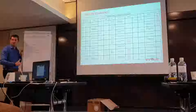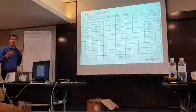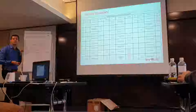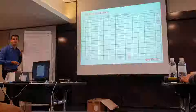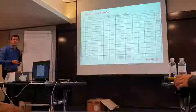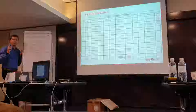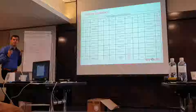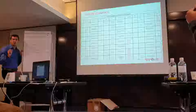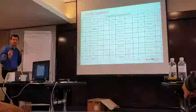Not only the minimum mode, it's possible to do it in normal mode, but there are specific things to respect. Read the documentation. Sometimes when I command PPS 1, the result shows okay, but then it shows the printer is online but status disabled. Take care, because if you change the PPS mode, moving from 1 to 0 or 0 to 1, you have to reboot the printer. Yes, you have to shut down the printer and restart it.